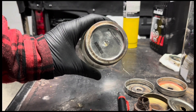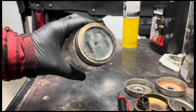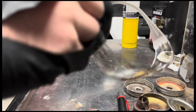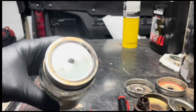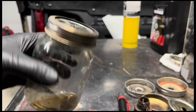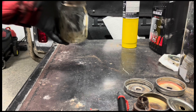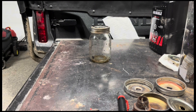The next most common mistake is a hole size that's too small. This one's 21/64ths. I've got my safety glasses on and I'm going to start this at a distance because there is a possibility it could shatter. I'm only doing this to show you what can happen — it's a very bad idea to go too small on your hole size. That's what happens; pretty violent, right? You don't want to do that.